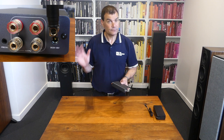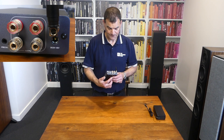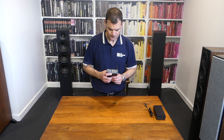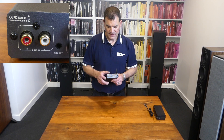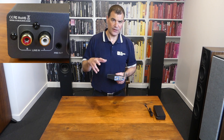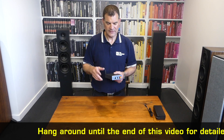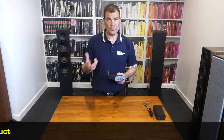Don't expect it to fill an auditorium with drum and bass, but it will easily drive a decent pair of bookshelf speakers and do a brilliant job of it. Beside the speaker outputs, there's a 3.5mm pre-out, which lets you add additional amplification if required, or use the unit as a Bluetooth source later. Then there's an RCA input. Out of the box, the RCA input operates automatically: when you pair a Bluetooth device it becomes the priority, playing Bluetooth first. Unpair your device and it defaults back to RCA — which is kind of cool if you use both sources.